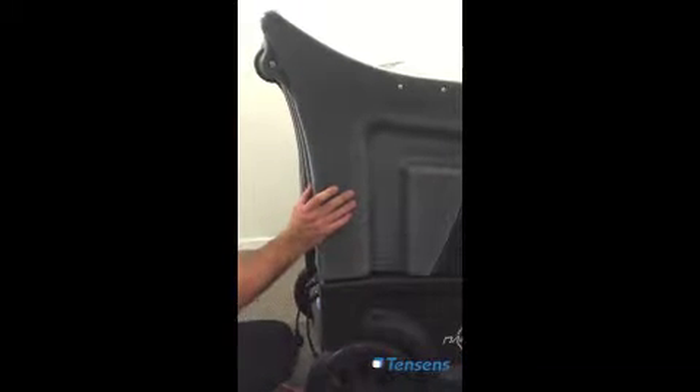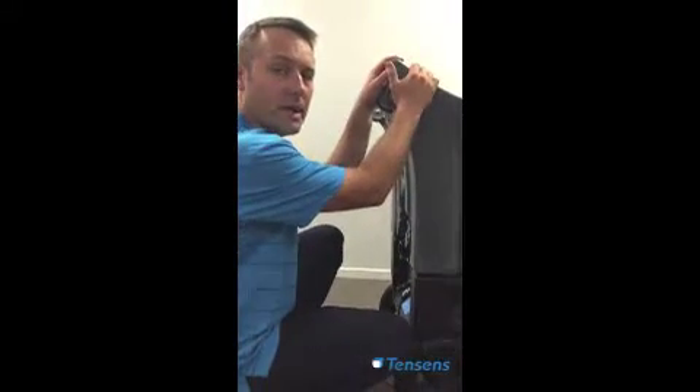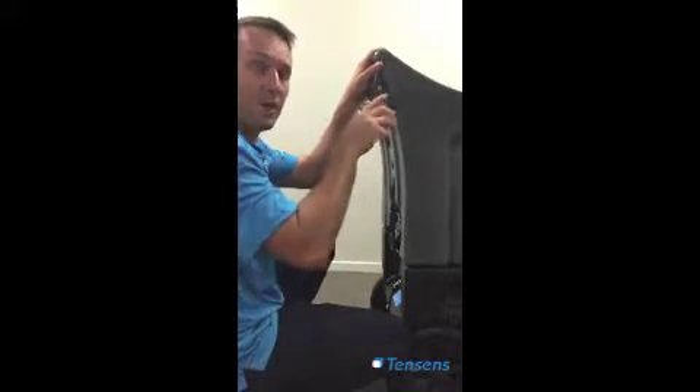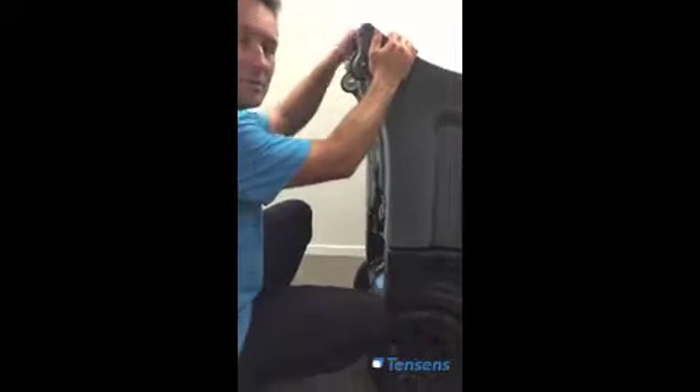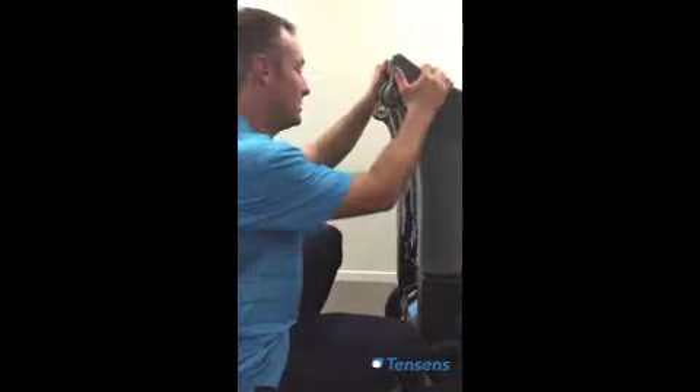As you can see, it's concave here. Only the two wheels, when we remove our spout, are sticking out. You can lay the machine down, roll it in, and lift it up onto these wheels. When you tilt it over, that wheel goes onto the back of your van — lift it up at the back and roll it in. The machine can lay on its back; there's no problem with that. It's got a grease piston and bearing rather than an oil bath pump. Those grease bearing piston pumps can last up to about 1,500 hours, so there's no concern about that.